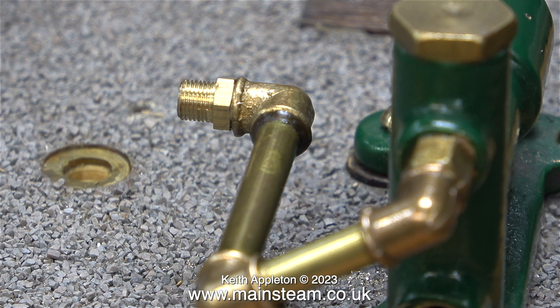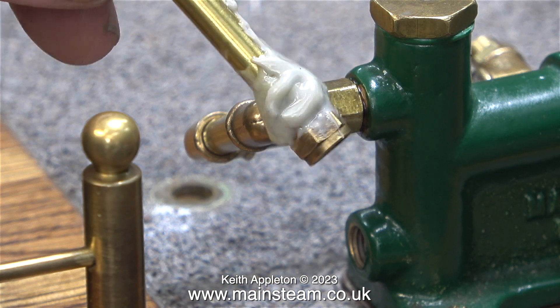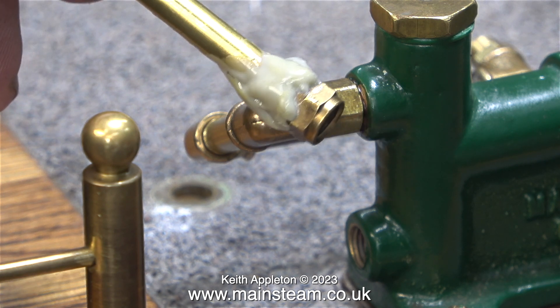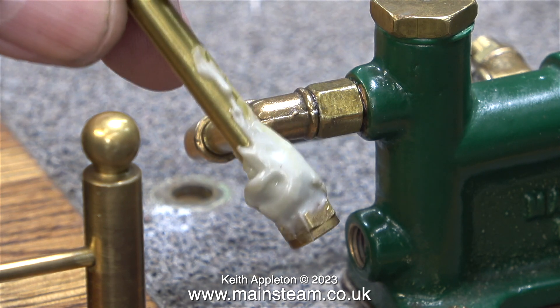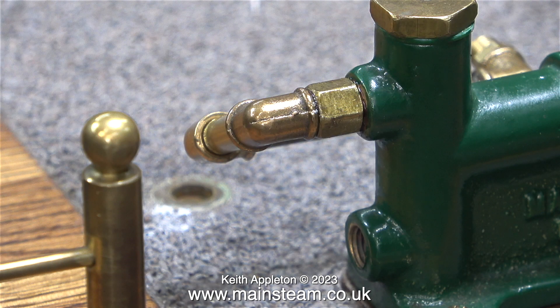Having a look at the pump connections I can see that one of the PM Research elbows has been made leak-proof by using what looks like epoxy resin or something similar. In a box of PM Research parts sent to me by a customer I found quite a lot of epoxy resin that's been used to physically stick a union nut onto the end of a piece of PM Research brass tubing. There are always different ways of doing these jobs, but for the moment I think I will stick to Loctite 542 — it makes the job a bit neater.